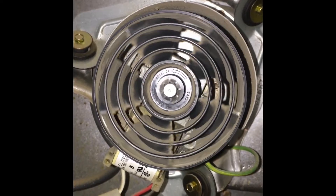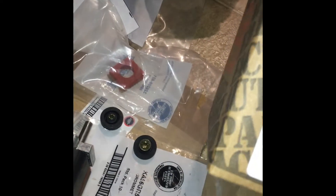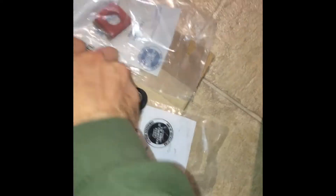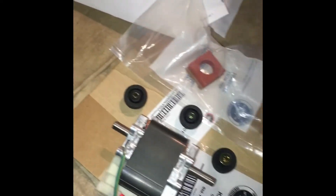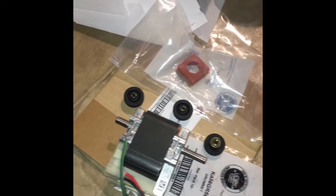It kind of seems like it's wobbly. I bought a rebuild kit from Shorty's. It comes with the replacement inducer motor, which should be a direct replacement — same number, same speed. It also comes with the isolators and the new fan on the inside. You could just buy the motor, but the cheapest I could find on Amazon was $145, and this whole kit cost me $167 with shipping.